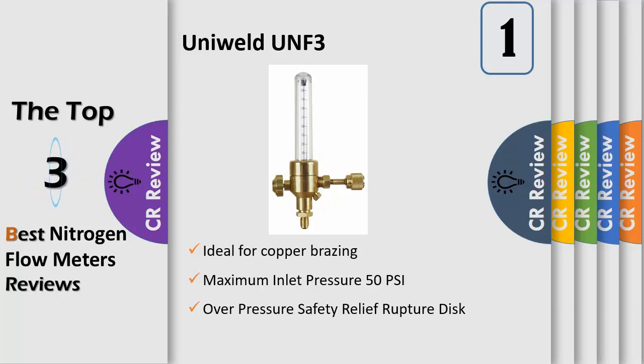Scale build-up inside the tubing can cause blockage in the TXV and within the air conditioning and refrigeration system, resulting in premature failure.